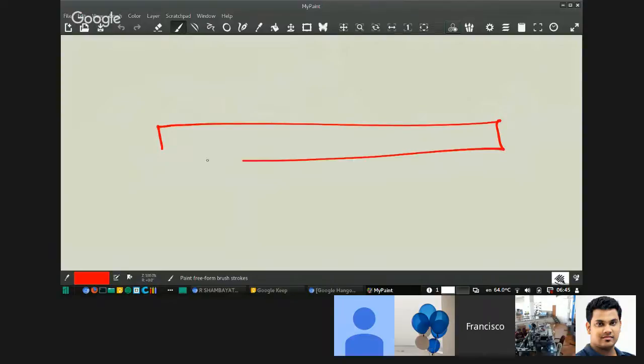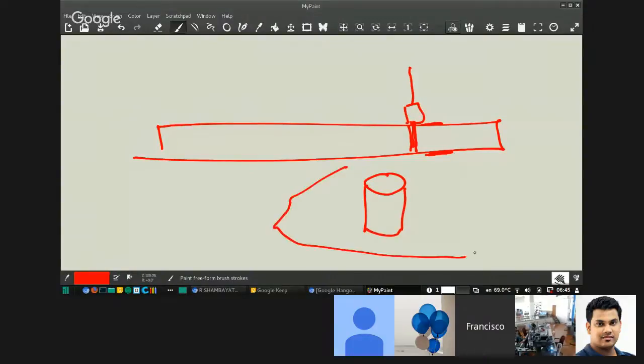You make this board like this, you make a hole here. You put the component here and the other thing going here. But the copper is on this side. And even if you have copper on this side, the hole, like in the other boards that you will see, has copper in here. Okay, the walls are made of copper, so they can pass the electricity from one side to another.